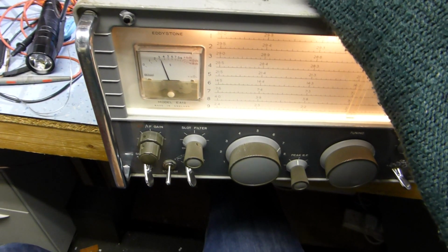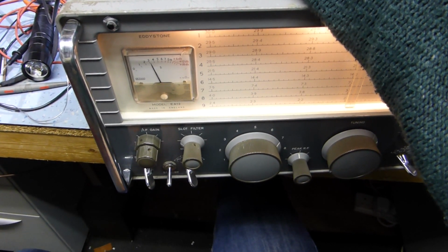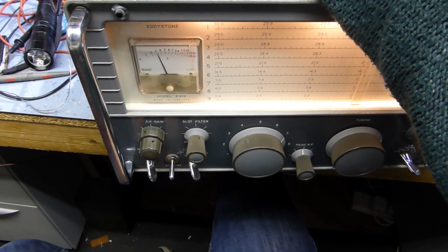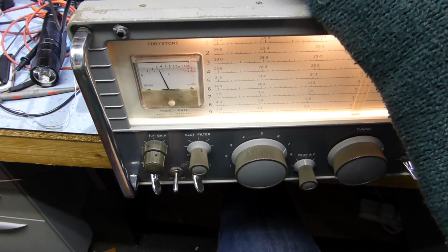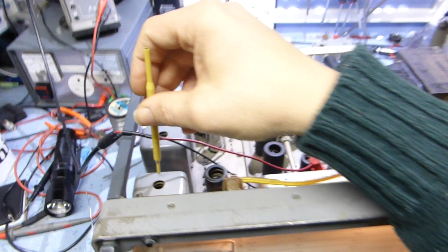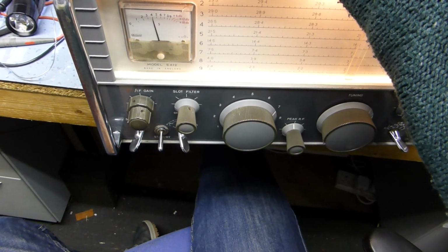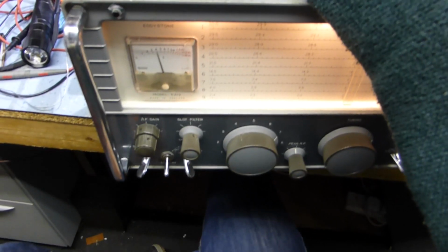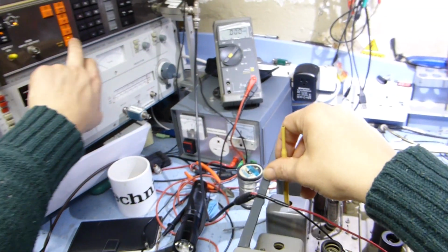So the Marconi is generating the 100 kilohertz. I'm going to go through the transformers and see if I can make sure I'm not tuning on a second peak. Should be doing this on narrows, sorry, wrong setting. Just again for peak. Okay. Well, that must come up. Turn the RF gain down a bit.